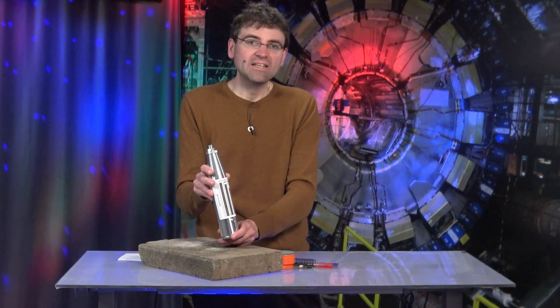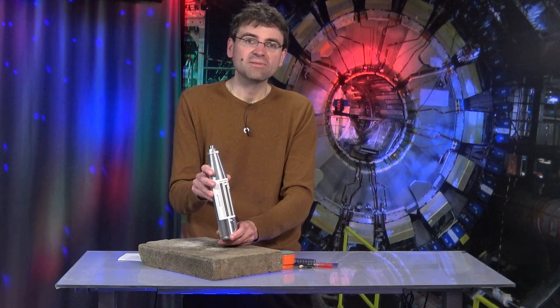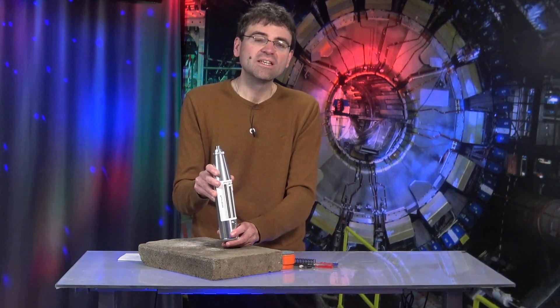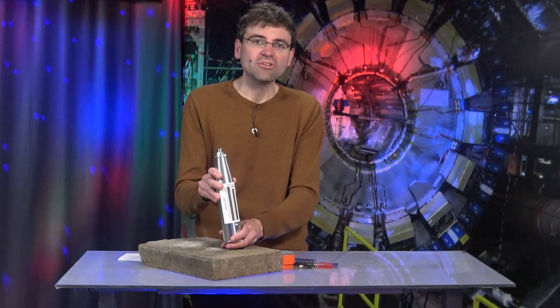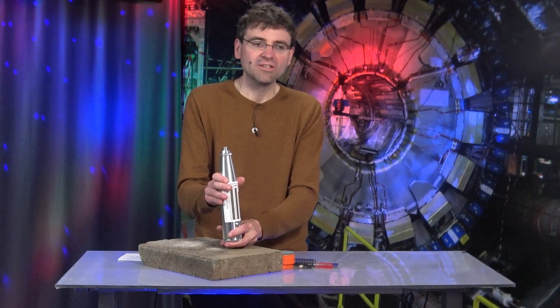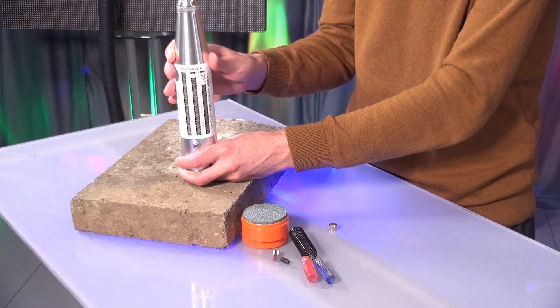The value is expressed in kilograms per square centimeter. The device is able to measure from 100 to 600 kilograms per square centimeter. And it is not only used for the actual purpose — i.e., for the hardness of stone and concrete — but also for the winding test on things that are wound onto rolls, to check how good the winding is. A nice, simple analog device.